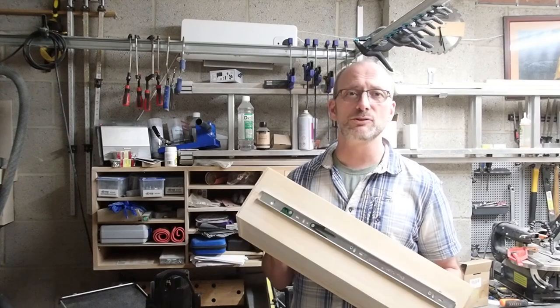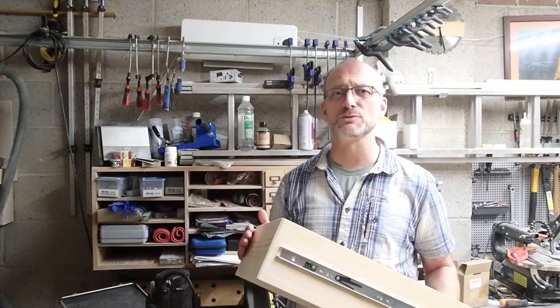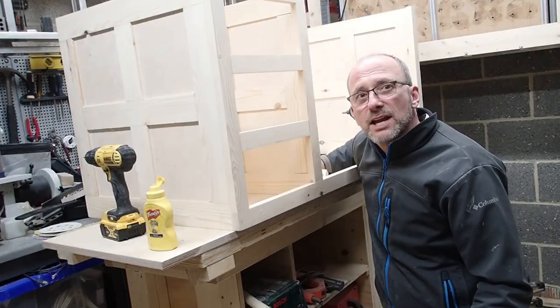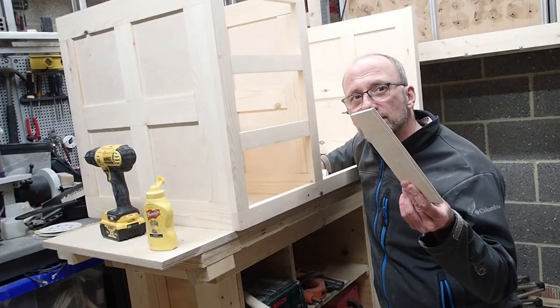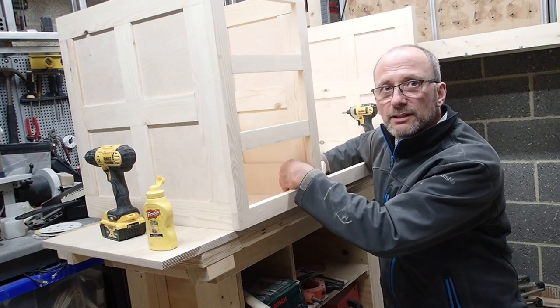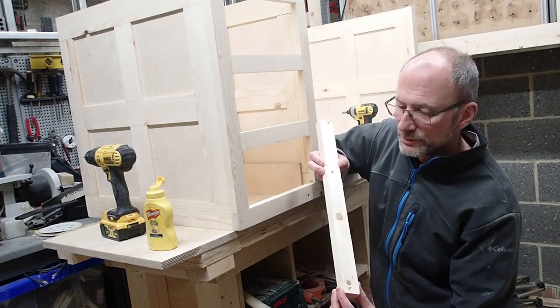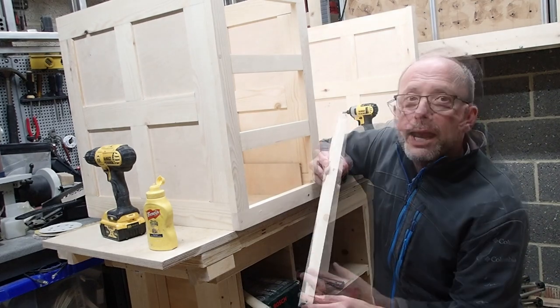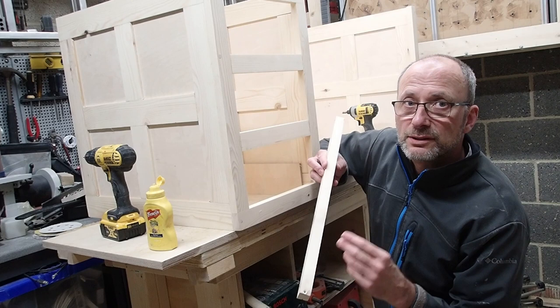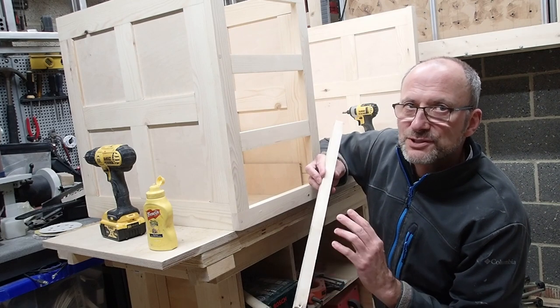For this video, I'm not only going to be showing how to make drawers, but also how to install soft close runners easily. Okay, so it's time to put the drawer runners in, and I just have a simple spacer here, made from some ply. I'm going to slip it in here, and I have the supports for the drawer runners already pre-drilled. I've marked out where they'll be touching the verticals. That way I will only use glue where it's needed and I won't have it dripping anywhere.